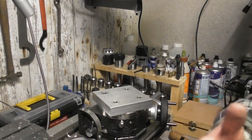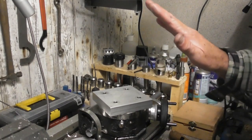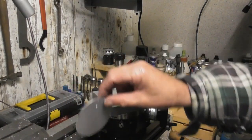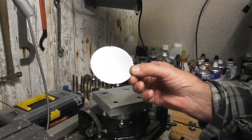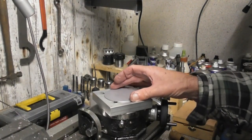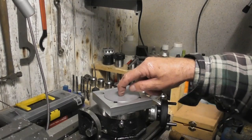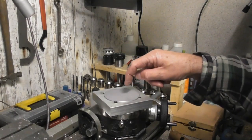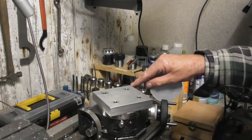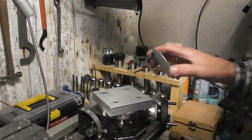First time I've really ever relied on it to be accurate, and it has proved to be accurate. This is only a cheap rotary table. It's not an expensive one. But I used the 3D printer to print this off, and just dropped it on the top and spotted out where the holes would be. Obviously, the 3D printer is going to print that accurate. There's no guesswork. All I did was found each corner and measured in. Sorry, I drew a line in, not measured in.